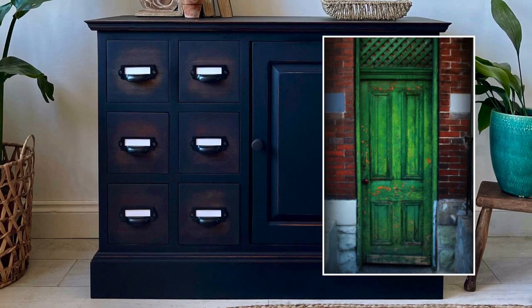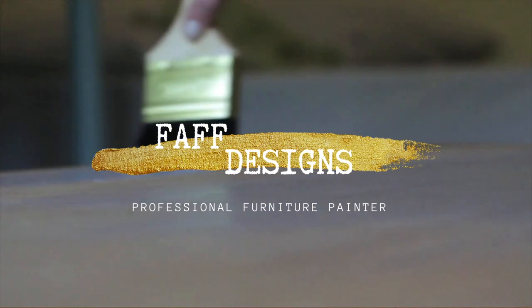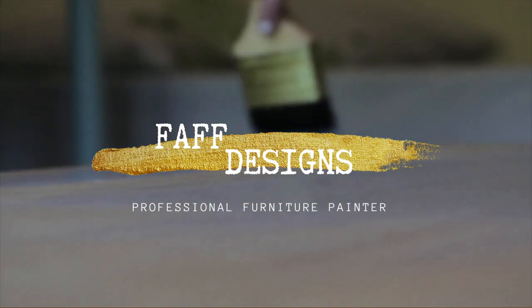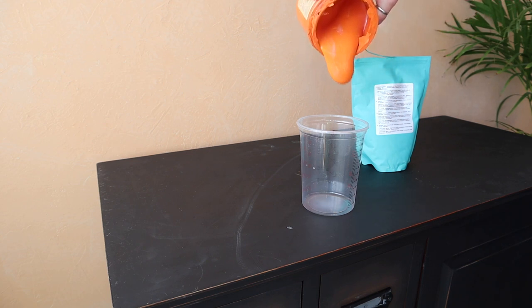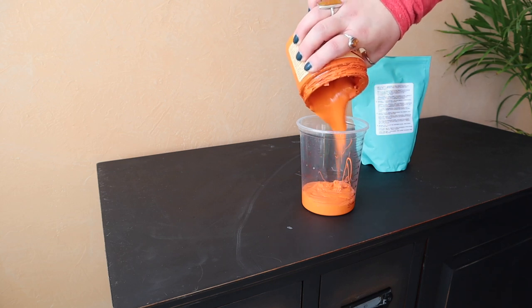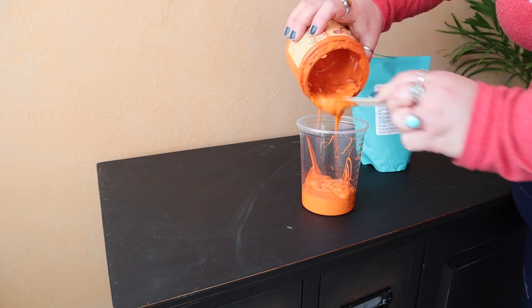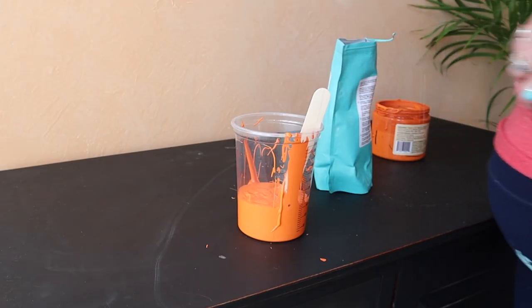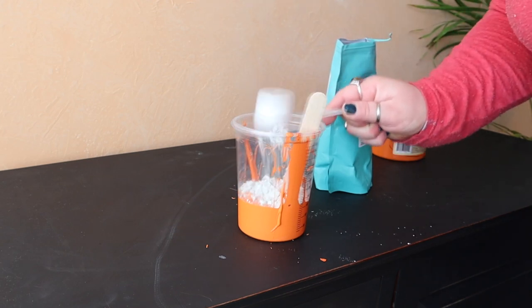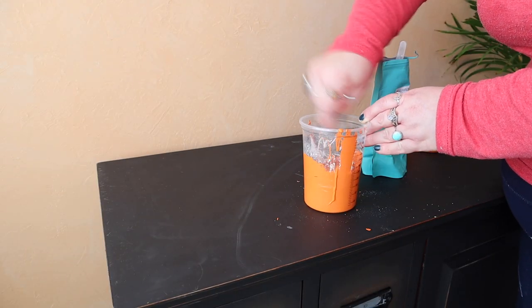Here's my inspo pic — we're going to change it up with a little bit of color using chalk mineral paint. I'm going to start by using a mixture of very thick paint, and to get that I'm going to use Dixie Belle's Sea Spray, which is a texture additive. This bright orange color is going to be my base color. I'm adding it into a measuring cup and then adding a whole load of Sea Spray powder texture additive into my Florida Orange paint to get a really thick mixture. Just make sure to give it a really good stir so that you mix all the texture additive together.